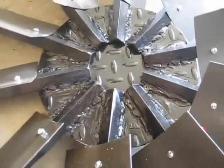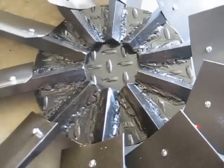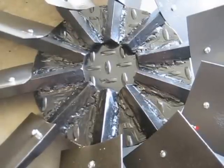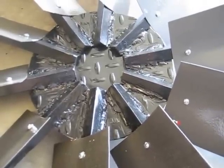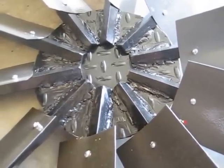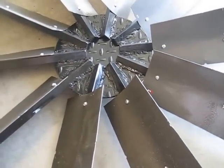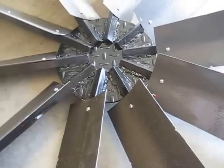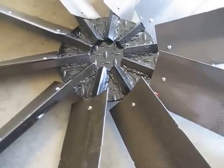This was one of the most challenging aspects of building the blade assembly — getting that layout correct. Take some time, do it correct. Once you've welded your angle iron, there's not a whole lot of options; you can't do it over. I had the steel circle cut out by a welding shop so that I could make sure it was a precise circle, that way we're evenly balanced.